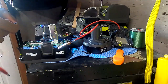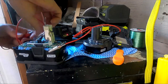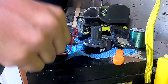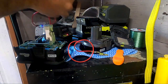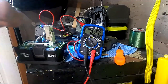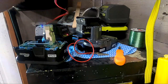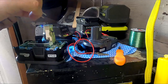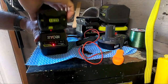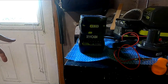I'm not getting a good connection at first - that's the problem. Honest to God, this just worked on the other battery. Now we've got connection and we're sending some juice - I can tell because I saw sparking. I'll disconnect one wire and give it a quick test on the voltmeter - 16 volts! That's how you jump-start your Ryobi battery. To prove it works, I'll put it back together without screws, smash it on the charger - and it's charging like a champ, even showing the charging light on top. That's how you fix your Ryobi batteries.